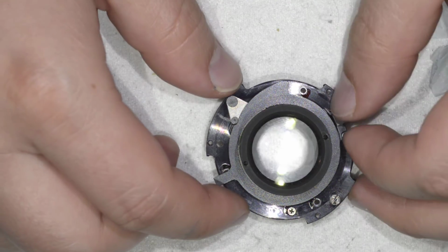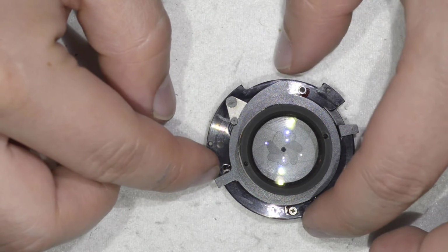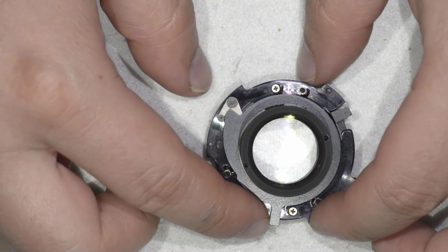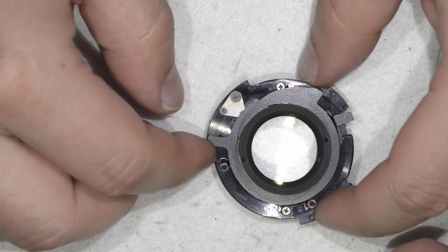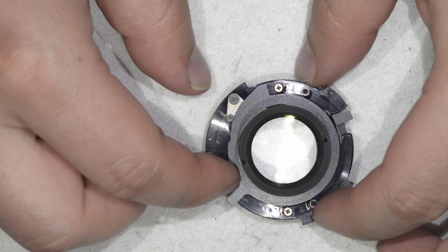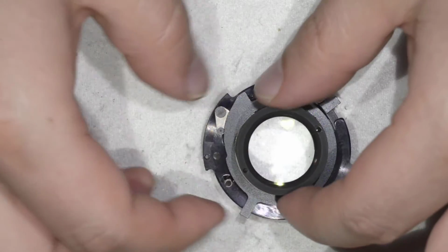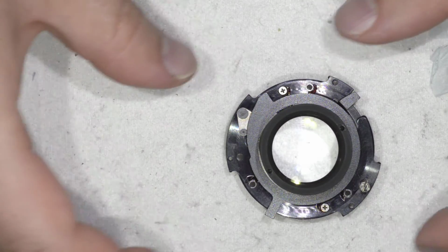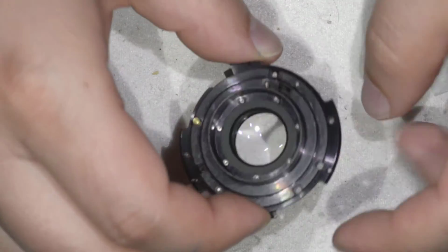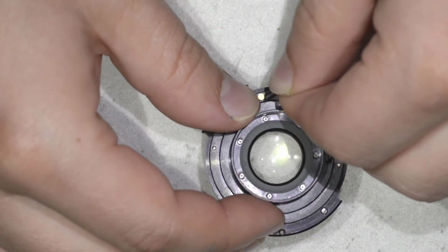and then you can come here, put this thing again in position. So what this cam does is, when you move this thing here, which is connected to the aperture ring, you will get the position of the diaphragm. Okay, so this is the thing, and here on the screw part, you have a small slot that you can play with in the relative position, so you get the maximum aperture of the diaphragm. So now here, if we put the spring, you will see the thing actually at work.